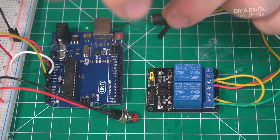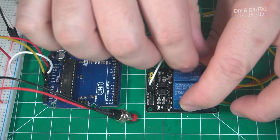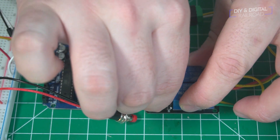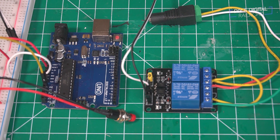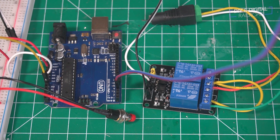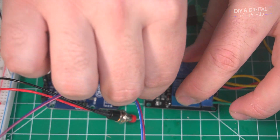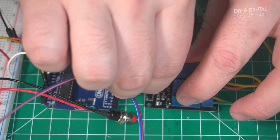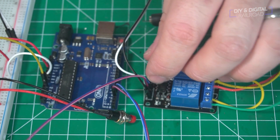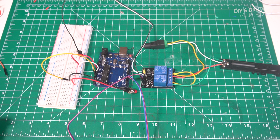The last thing I need to do is bring power to the relays, which have a simple 5 volt and ground connection on each side of them. Next, we're going to connect our control pins to digital pins 3 and 4 and connect those to relays 1 and 2, which are the only other two pins available on the relay. I have a schematic below. That is the entire build for this.